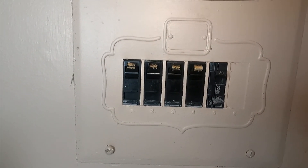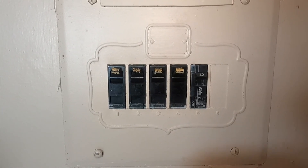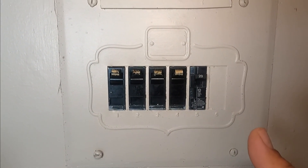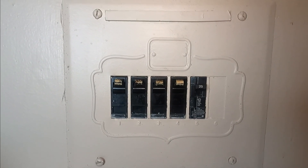That's it guys — we replaced the 15 amp breaker with a 20 amp. It was borderline, drawing 12 amps on an old 15 amp breaker. For an air conditioner it should be a 20 amp breaker, so everything should be good now.